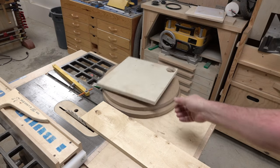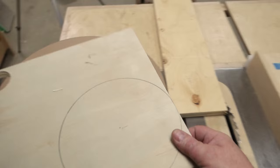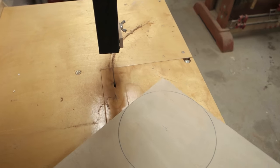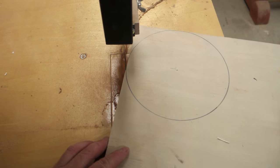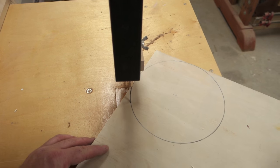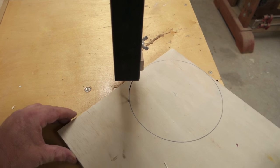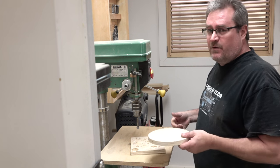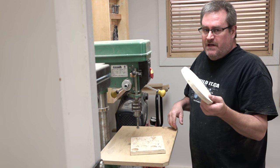The aluminum pulley is too small — I really don't have a good match for it in the smaller pulley. So I'm going to make a new one, a 7 inch one, maybe 7.5, from this 3/4 inch plywood. I could have gone out and bought a real 7 inch pulley but the idea was to use what I had on hand and make it quickly. It really won't take long to do this.